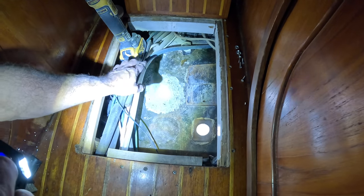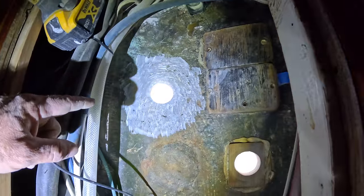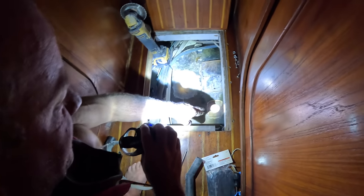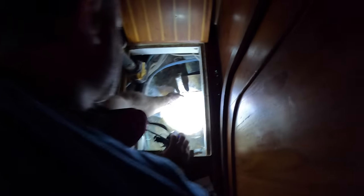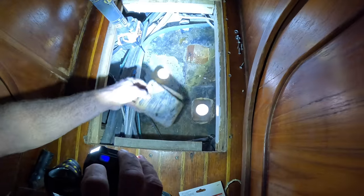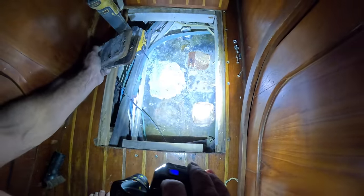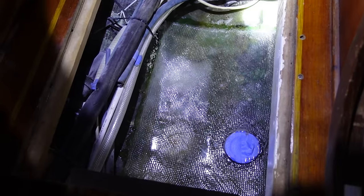So here's the through-hole. I'm going to grind this down — I've ground out the outside. We're going to fill this hole in. We only need one transducer. That was a paddle wheel, and over here was the transducer, so it's all going to be in one now. There's actually old blocks down here. I'm going to remove these, which I've just cracked off. I'm going to clean this whole section up and just re-glass the tops and tidy it all up. You can see there was a hole here, there were holes there — super thick. I'm just going to tidy it up.